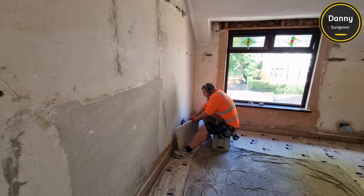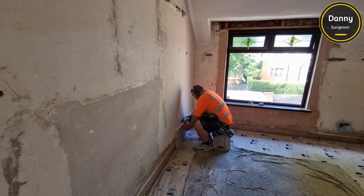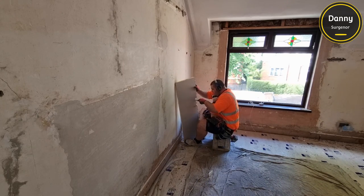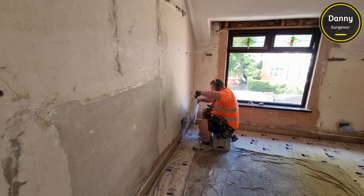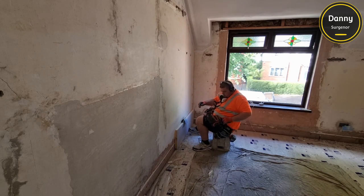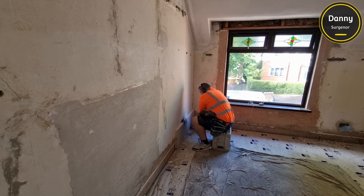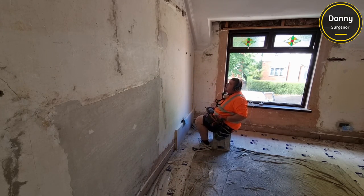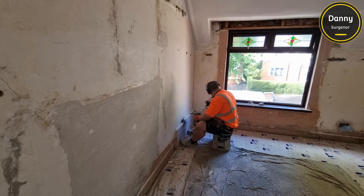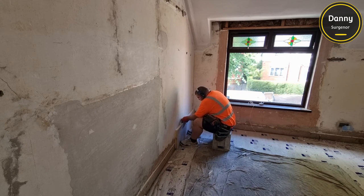When we've got our board cut and we're going round sockets, what I'll do is cut the bottom piece of plasterboard. So you can see here I'll measure from the top of the box to the floor, leaving about half an inch at the bottom, and then I will cut the box out of the bottom bit of plasterboard. The top of that bit of board there is along the top edge of the socket. Once we've got it screwed in, then the bit of board that goes on top will sit and create the top edge of the new box.